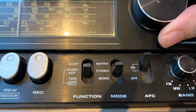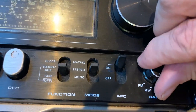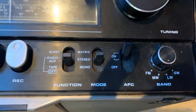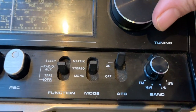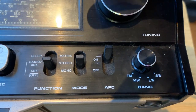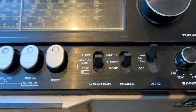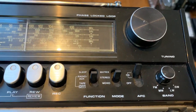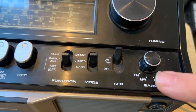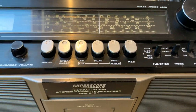There we go - we've now got short wave. Long wave - yep, got something there. Medium wave - there we go. All we're trying to do is literally just move the controls to the point where we can hear something. We've now effectively got our volume fixed and all the radio bands are back, and we haven't done anything except literally just turn the dials and move them from their original corroded positions. Once we get inside we'll clean it properly anyway, but this just lets us know that there's nothing fundamentally wrong with any of the radio circuitry.